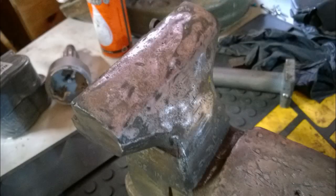I've put a little body filler on the horn here after stripping it — that greenish section is the fiberglass body filler. You mix up a little bit, smooth it on, then sand it off. You'll probably have to do a couple of sessions to really get it nice and smooth. Most of the vise had some dings and dents, so we smoothed those out in particular. We're then going to coat this with epoxy primer, then Rust-Oleum verde green paint, followed by clear coat for extra shine and toughness. The anvil also gets body filler, but silver metallic paint instead of green, just for contrast — and it'll also get clear coated.